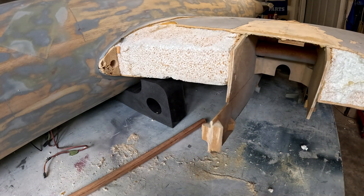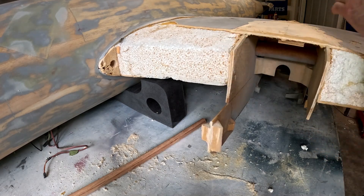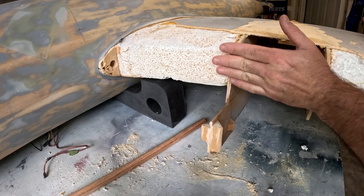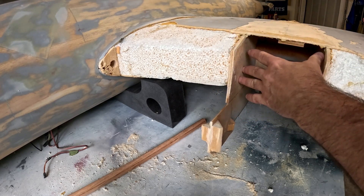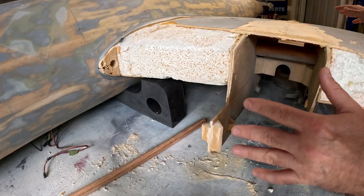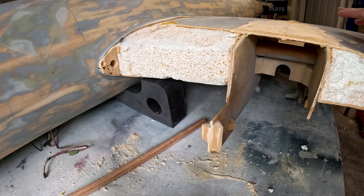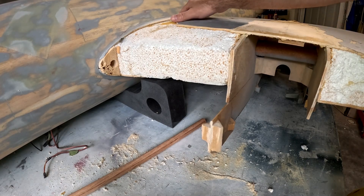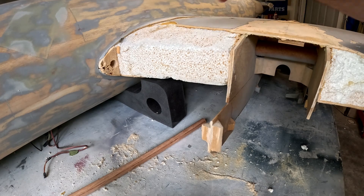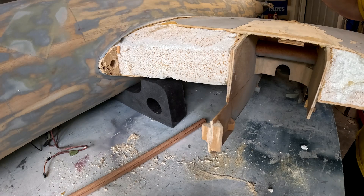The goal is to get as much rigidity built back into the airplane as possible. That will get the firewall piece bolted or glued up onto these plywood aircraft ribs, which will help box in the whole structure with the trailing edge and the wing tubes. That way we have a nice, structurally sound wing section, and then I'll start removing sheeting from the top of the wing to fix the spar.